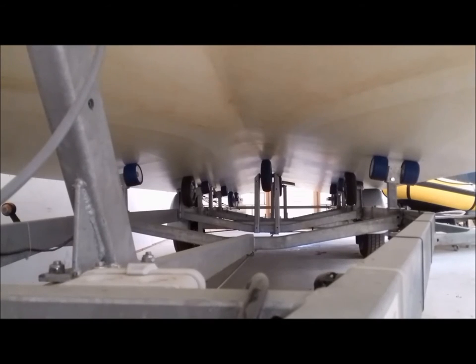Here is a look underneath the hull. As you can see it has a V shape. The sides of the boat are in the water and the bow wave is allowed to get away underneath the boat, which also helps lift the boat when speed gets higher. That creates a lot of bubbles under the boat, reducing water resistance, enabling about 10 kilometers per hour with only 2.8 kilowatts of motor power.